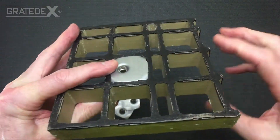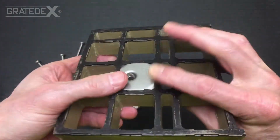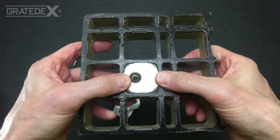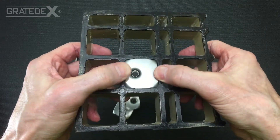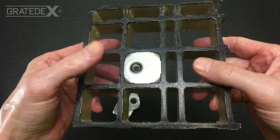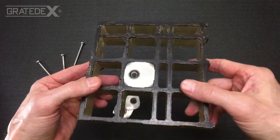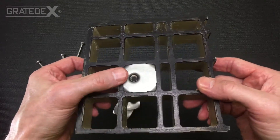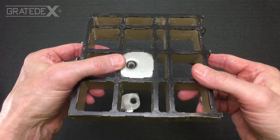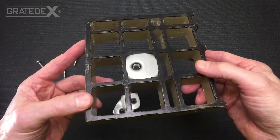This attachment with the screw through the fastener contacting the deck plank itself gives maximum tie down and maximum compression load attachment to the framing, sufficient that this will sustain high wind uplift hurricane load applications when assembled in the PK-01 with the glue-down tile to the surface, making this suitable for those high wind, high load, uplift applications.